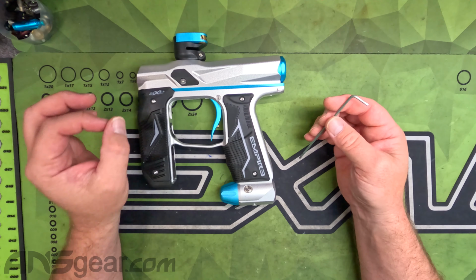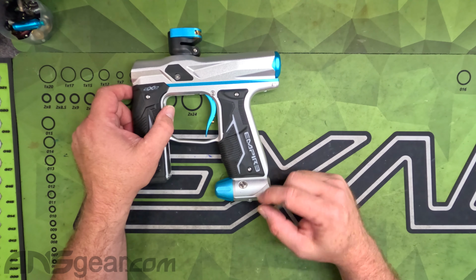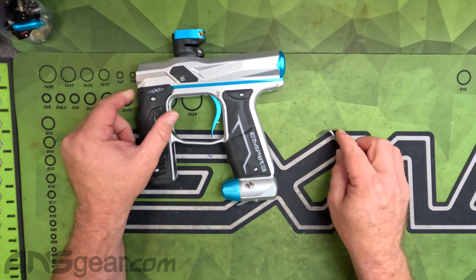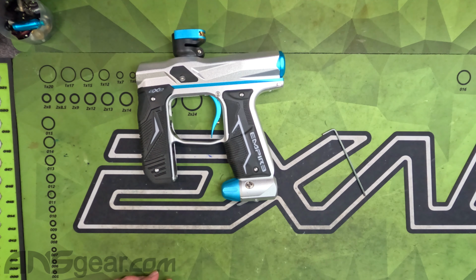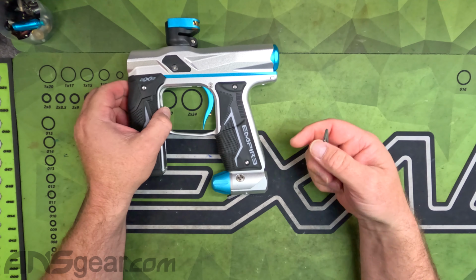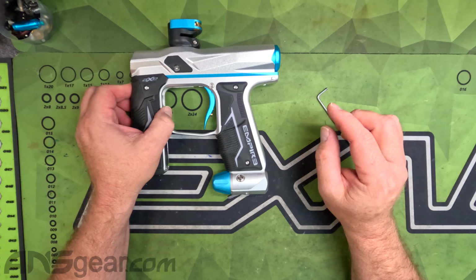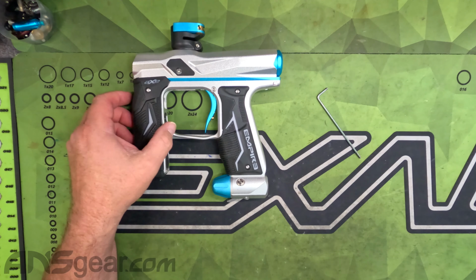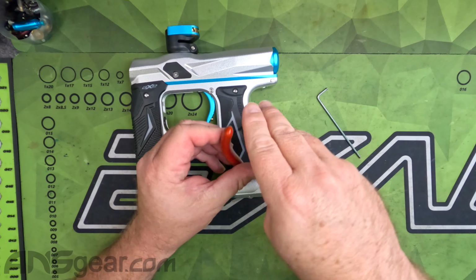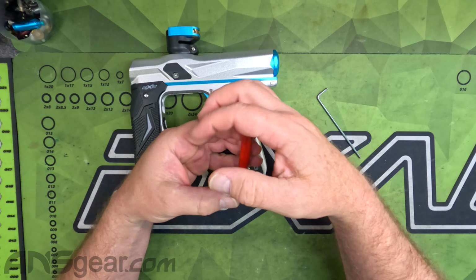Absolutely, 100% would happen. If you had a tank on this and it was pressurized and you turned this in, basically you turn the screw in, you're increasing pressure. And when you increase pressure, at a certain point, this regulator is going to purge. It's designed to bleed off that pressure. If we look at this section of the regulator right here, and I take this out,